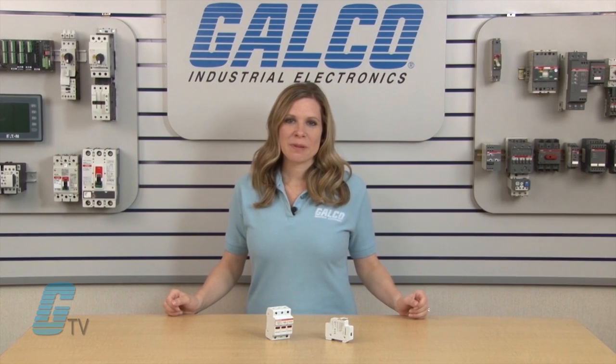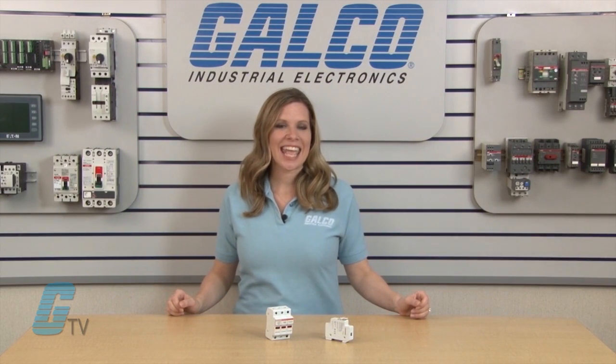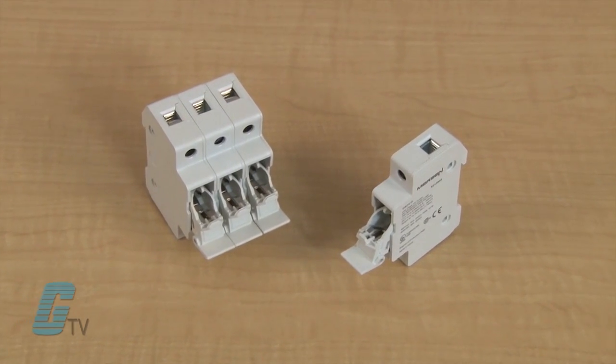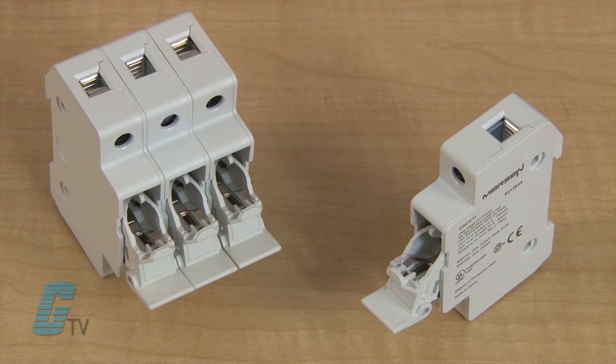The multi-pole units can also be made up by ordering pin tie handles or field assembly. UltraSafe holders save up to 15 percent of mounting space and any combination can be snapped onto a 35mm DIN rail for extra savings in panel building time.